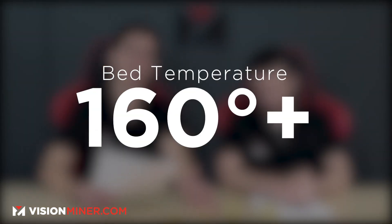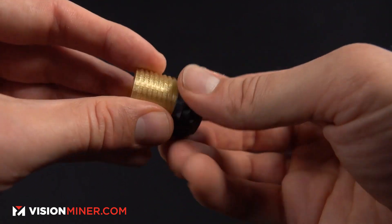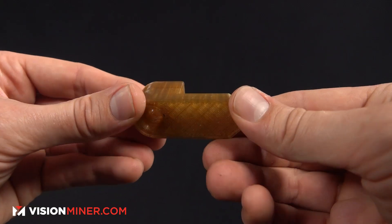You print this stuff around 370 to 390°C on the nozzle, sometimes hotter if you're going faster. The bed — you want that as high as you can. You can do small parts at 120°C, but we recommend 160°C minimum on the bed and as hot in the chamber as you can get, up to 180, 190, 200°C. You're going to print around 20 to 30 millimeters per second. For good layer adhesion, you've got to permeate down through the layers. There are techniques for going really fast and hot, or slower and lower — both can work depending on the geometry of the part. We printed an actual bed surface with a 0.8 nozzle, printed it slow, and it worked fine.